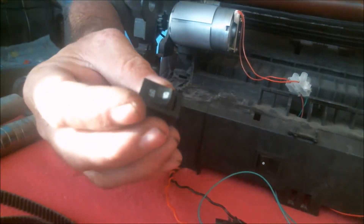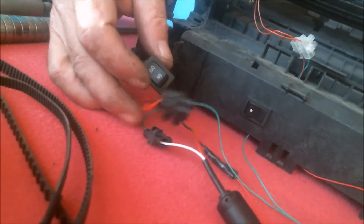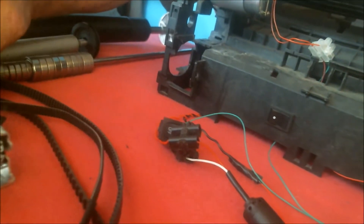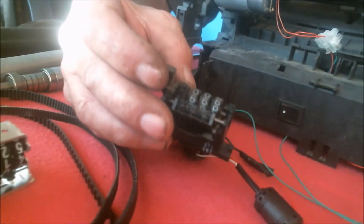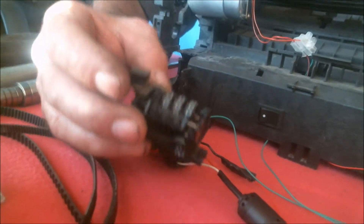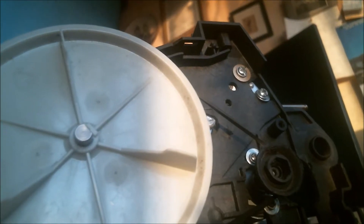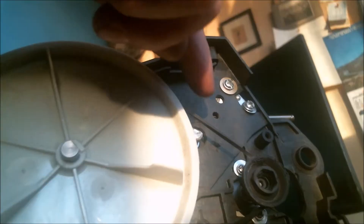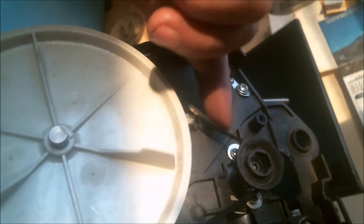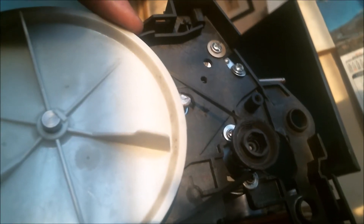On-off switches, wiring, and connectors — all these you will find in printers and other electronics. You might even find counters that you can adapt to see how many turns per minute we have in our tumbler. The most simple drive mechanism is a flexible drive belt that connects the driving sheave or pulley on the motor to the driven sheave or pulley on the main roller.